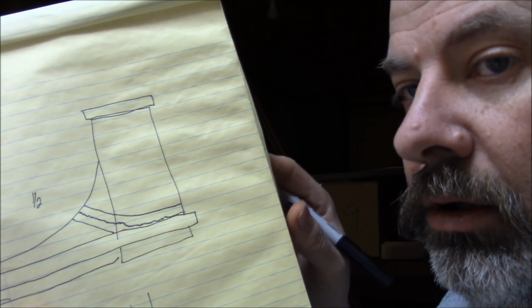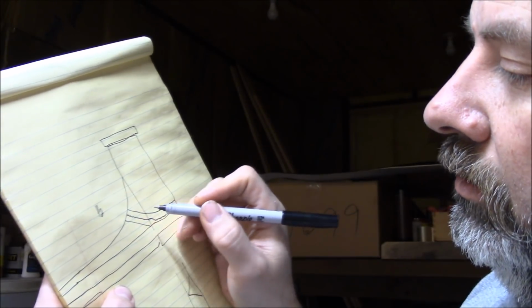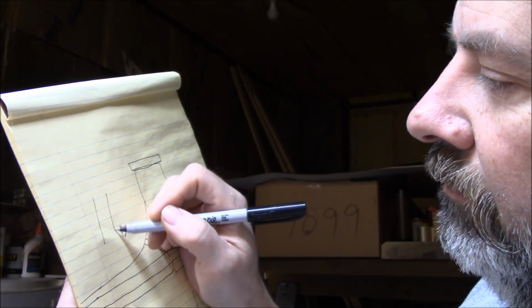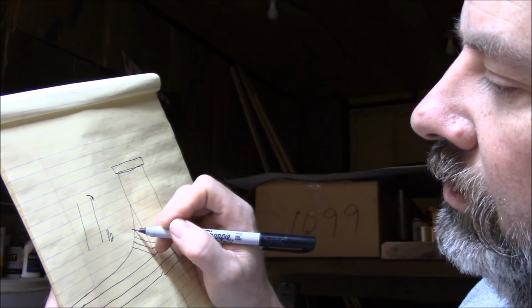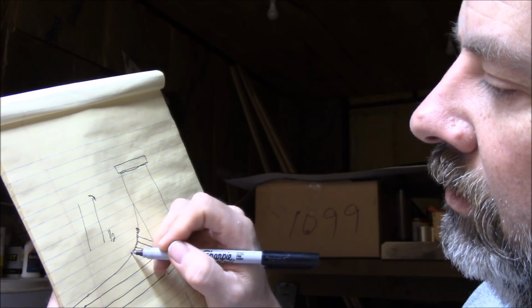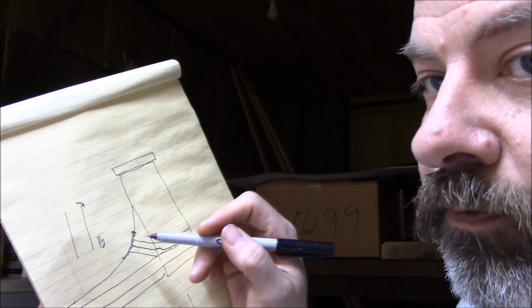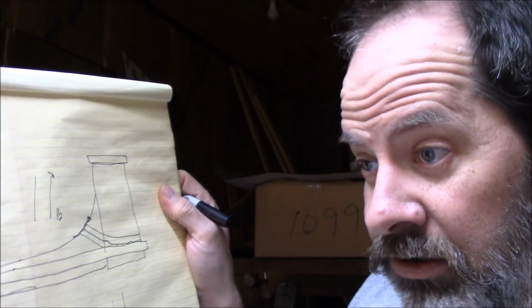On the square edge you will get what they call stress risers. So right here on this edge I radius the corners. You fill this up with weld, and when you're all done, let's say this is the front edge, you just round over that corner. Give it a round over with a sanding wheel all the way down across that weld, and that'll help eliminate further cracking, or a place for it to start from that impact. In the business we call it stress risers.